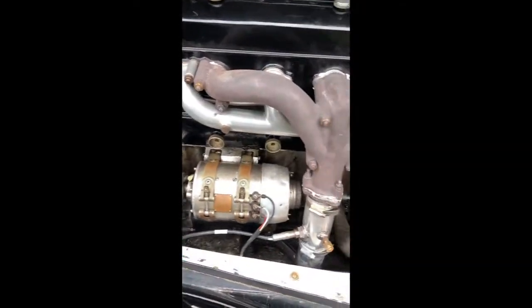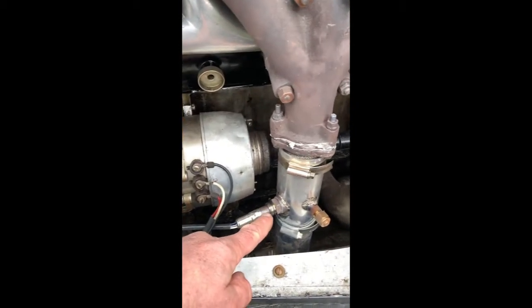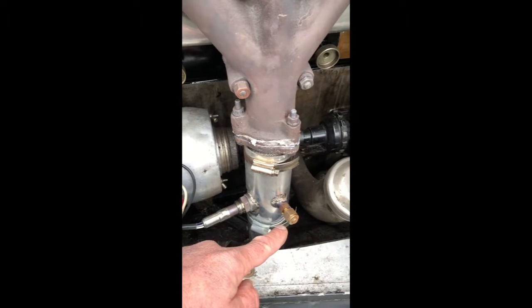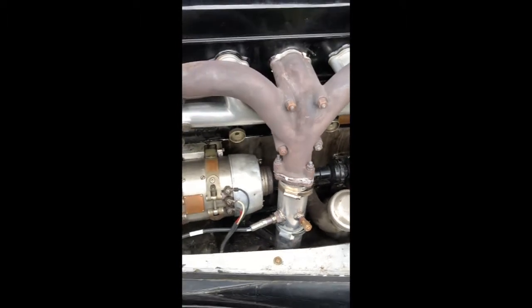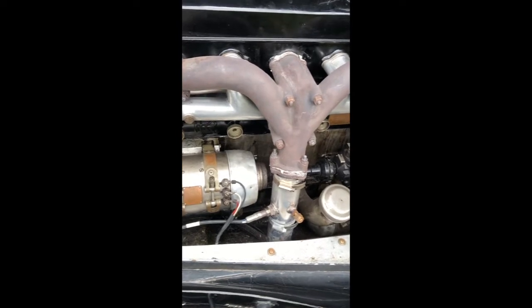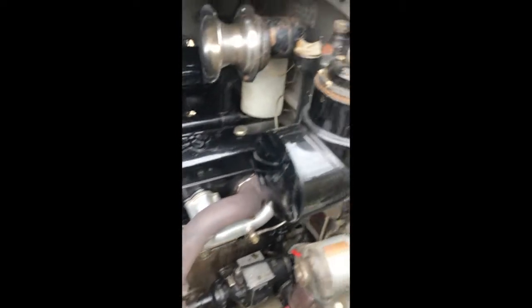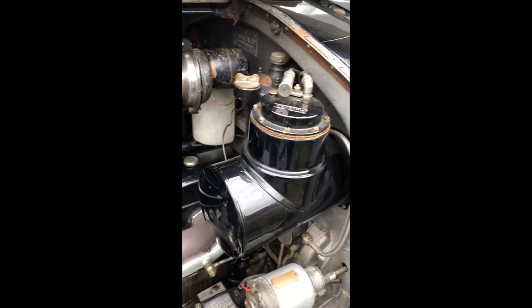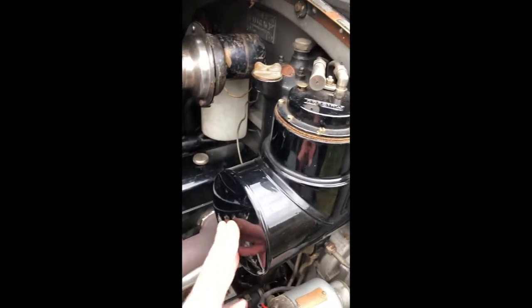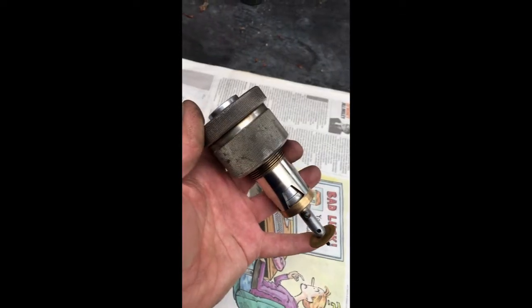Around the other side of the engine, we have our exhaust manifold. Here's the downpipe — this is where the exhaust gas oxygen sensor is fitted, and beside it an emission sampling point where we put combustion fast response analysers. I'll also show you the autovac fuel delivery system, which is connected to the intake manifold and sucks fuel up from the tank, putting it into the header tank where it's fed by gravity to the carburettor.